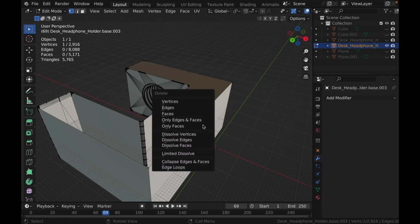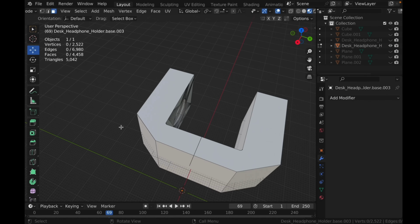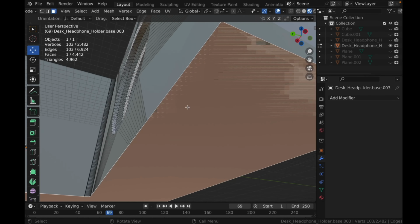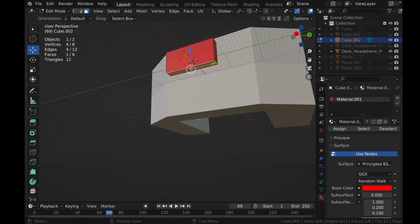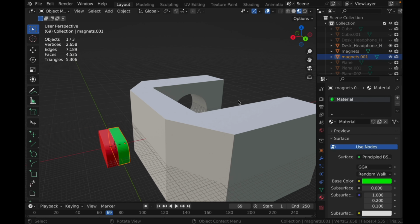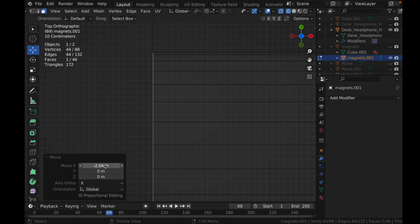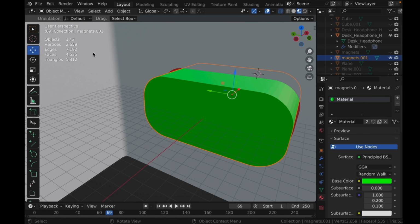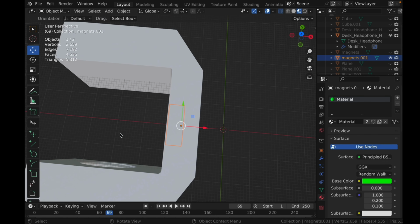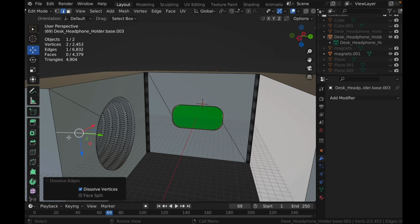I then cleaned up the geometry by closing the duplicate screw hole and taking out most of the bevels. I knew that for the most part I was going to be using more square edges than the current rounder edges. In version 1, I was testing the magnets I had on hand, which were only 8 by 3 millimeters. I wanted to get a gauge of how strong the bond would be with these magnets.